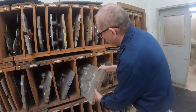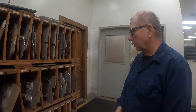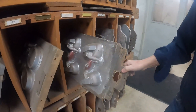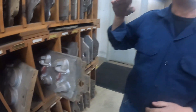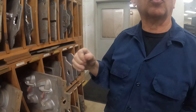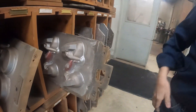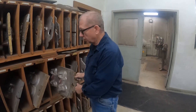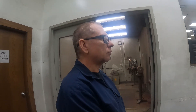The castings are made out of red brass, which is 85% copper, 5% lead, 5% tin, and 5% zinc — that would be for the commercial helmet. This is the elbow that's used on our air hat. One port is for the main air supply, and the other port is for a bailout. They either run a secondary line, wear a pony bottle, or wear a scuba tank on their backs as an emergency gas supply.